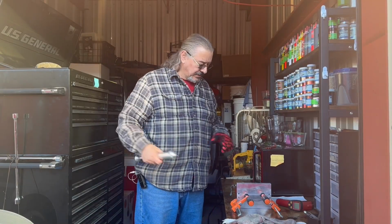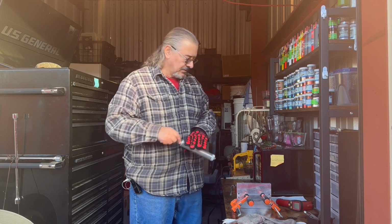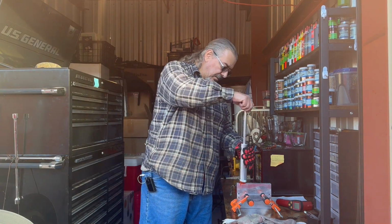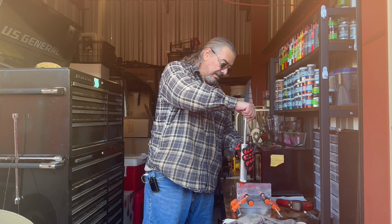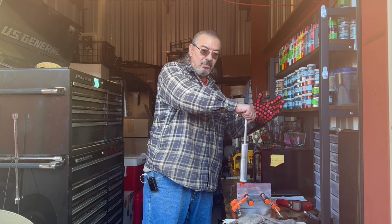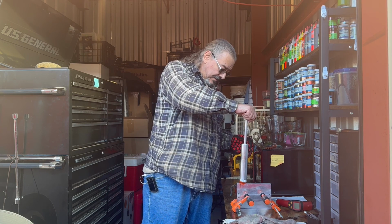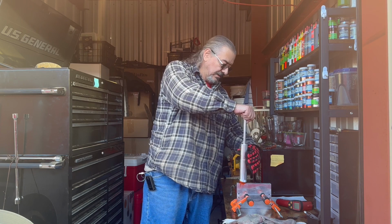All right, here we go. Let's go ahead and shoot the core. I got the plastic up to, I saw 379 as I was stirring it. So that's plenty hot enough for this. Okay, now when we shoot this, we want to be careful, nice and slow. Get it pushed in, because we don't want to force the shells backwards in the cavities. Don't ask me how I know that. Okay. Hold our pressure here, make sure we've got all that air pushed out of the cores.